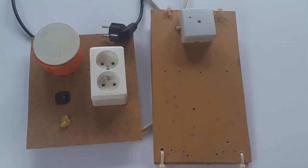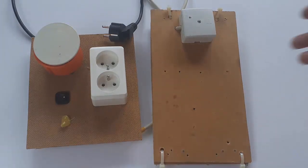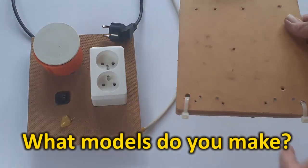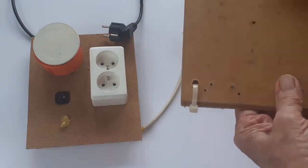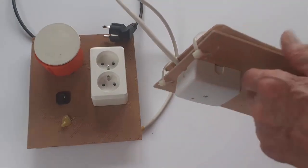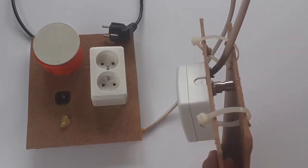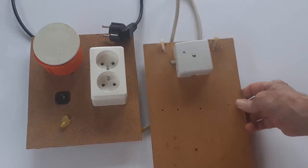This is a close-up view of the DIY foot switch. It is made from scrap MDF — I had things laying around and used them to make the whole unit. The switch itself is nothing more than a couple pieces of scrap MDF. I make the hinge out of cable ties. I had brass hinges, but the bolts and nuts protruded and scraped the floor, so I put cable ties in and it worked perfectly well. On the other end, I have a couple more cable ties to limit how far it opens. I put in a musician's foot switch — a link to get one is below — and that goes into a little electrical box as a security cover.